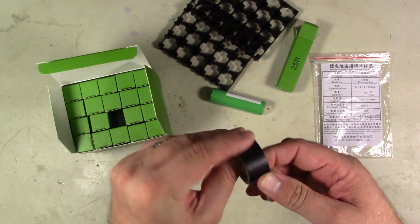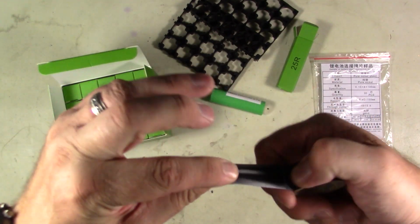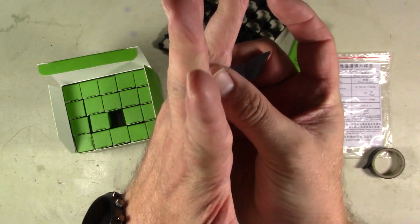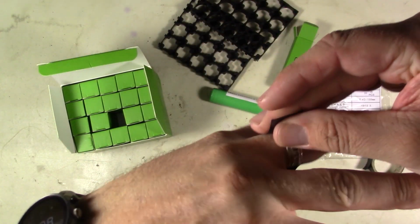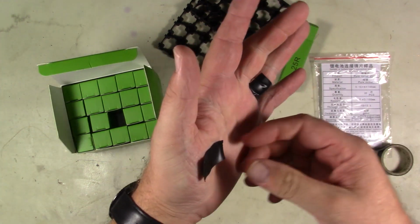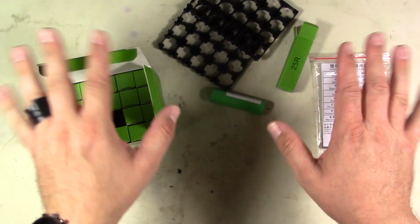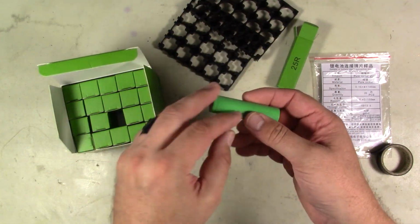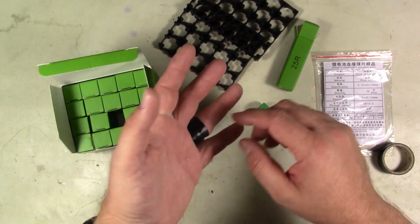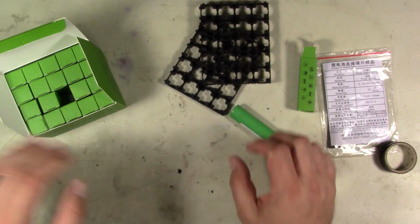Now, before I get started, like I tell everyone, when dealing with batteries, I used to build batteries way back in the day, and when you're dealing with batteries, and especially open packs, and you're soldering and you're welding, you definitely don't want anything metallic coming in contact with the battery, okay? Because these things, remember, are charged, and when they're charged, they can discharge, and there is no off switch. They will discharge till they stop, okay? So you do not want to get a ring or jewelry or something across the battery terminals, because it probably won't electrocute you. 18 volts is not enough to electrocute you, but it will short across your ring or your piece of jewelry, and it can literally melt your skin off because it's going to get hot. Not good whatsoever. So always take safety precautions.